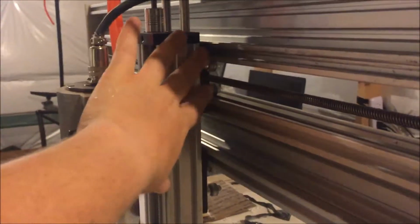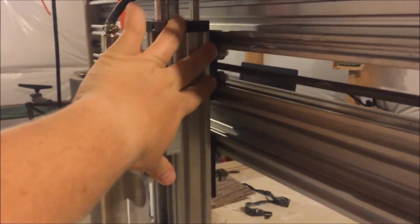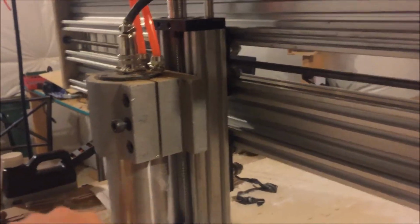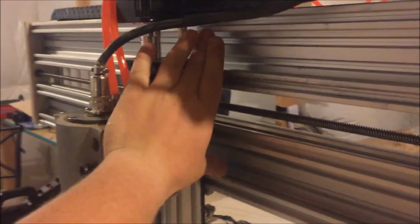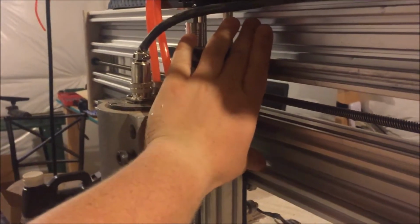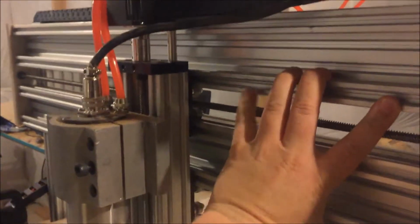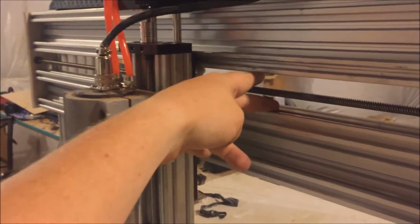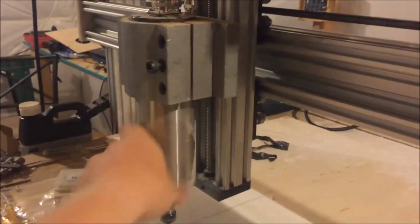If you put the screws in the middle of the two beams, the screw with the mounting bracket here, that makes this completely solid. The whole machine doesn't flex at all. I was looking at maybe getting the bigger one and running them farther apart. That might be an option for the future, to get the bigger plate that I put on the side and span it across these two, so at least then I get the integrity of those two members instead of just the ends. But that's the most rigid part of this build to hold this clunky motor.